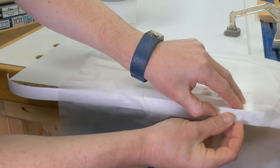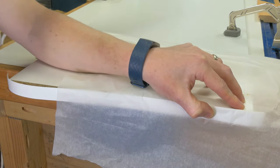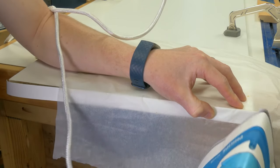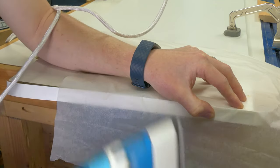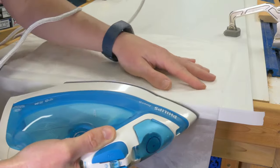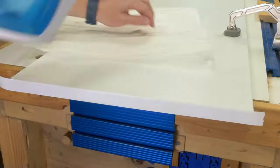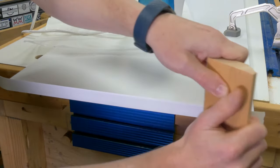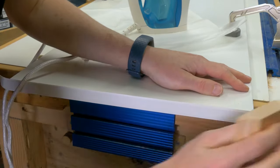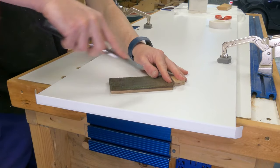Make sure you keep your piece of baking paper between the hot iron and the edge banding — otherwise it'll stick to the iron, you'll melt the edge banding, and you'll be starting all over again after a nasty bit of cleanup. Cut a piece just longer than the length you need. Overhang it on both sides and the ends. Start at one end, hold it nice and straight and stick it down for a second or two. Then run the iron backwards and forwards until the banding is pretty much just too hot to touch with your finger. That should mean the glue is melted and you're ready to grab a rounded stick, a dowel, anything with a gentle edge, and use pressure to push that edge banding firmly into the particle board.